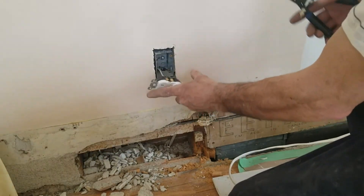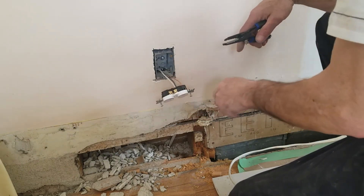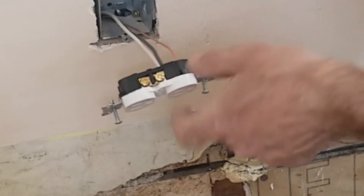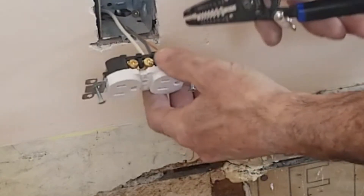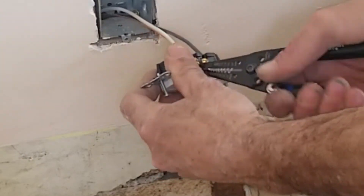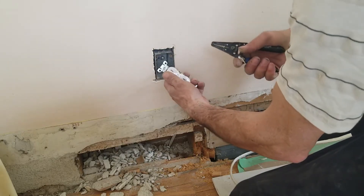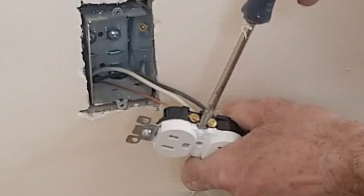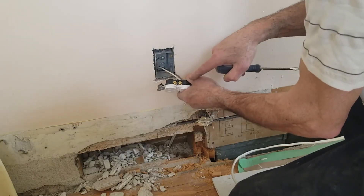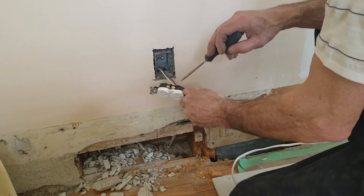Once you've disconnected the power, there's really only one thing to do here. You want to make this a split plug. Right now the way it's wired up — yeah, it's dead, I had to touch it to make sure — what's happening is that the black wire is giving power to this circuit and it's tied over to the other receptacle by this brass clip. What I want to do is break that brass clip clean off. Make sure they're not touching at all — I even pry them apart further with a screwdriver. So now you know that's safe. If I turn on the power again, this outlet is going to be energized, but this one will not because it's not receiving any hot.